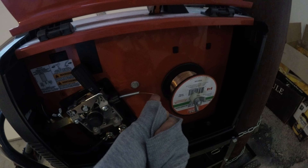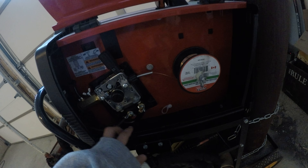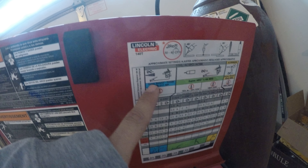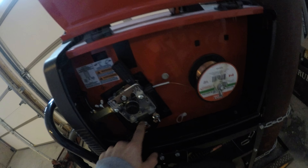When you're running regular copper wire it's electrode positive, so we are on DC positive for MIG mode. When you do flux core it's DC negative — you just have to swap these leads, so this would go here and this one goes here. Simple enough.